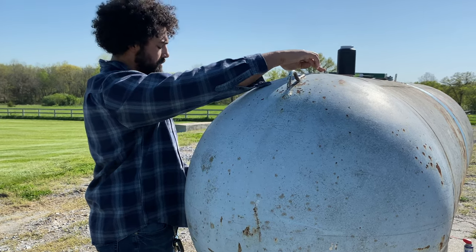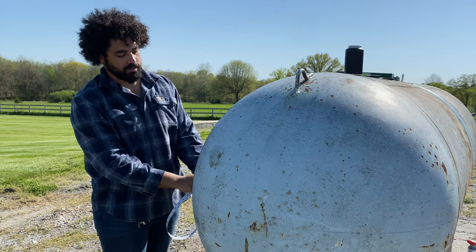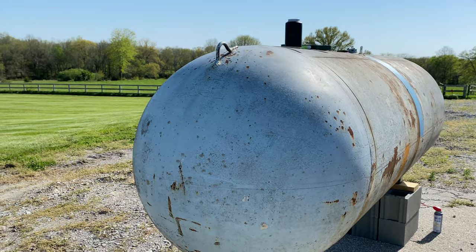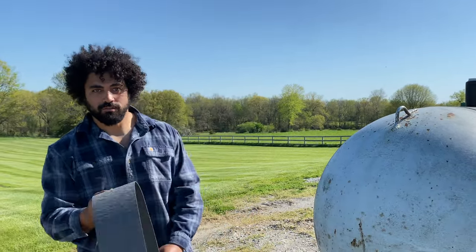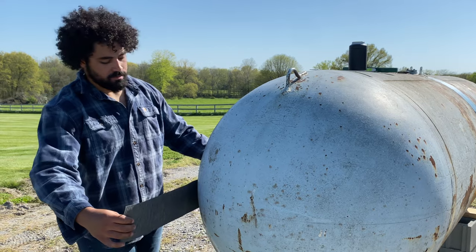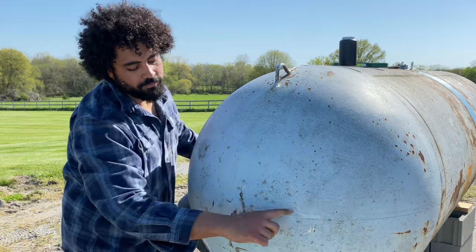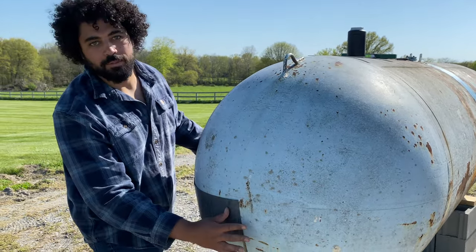For the collector, we did the same deal to make sure that this line was accurate. We got on our drop dead center up top, brought it down 29 and a half inches, made a mark, and then we just took our little bad mama jamma — link is in the description, you'll need one of these, don't even try to build your smoker without one. We marked our centerline over here and just wrapped this puppy around and met it. We drew that line, brought it there, drew the line on the other side, wrapped it around.